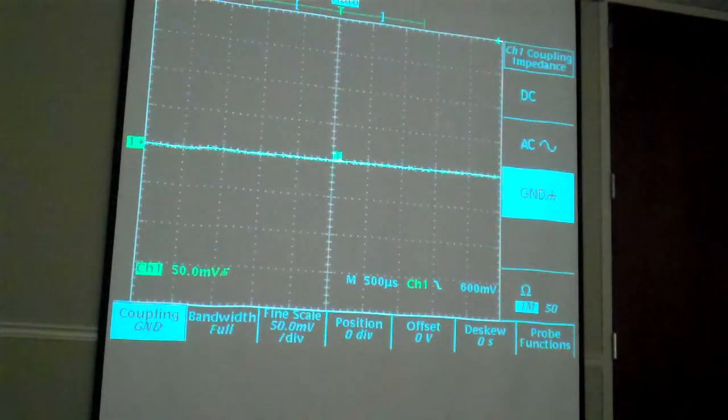Well, in the case of using an oscilloscope or any other piece of test equipment, that's something we always have to keep top of mind as well. Whether it be a multimeter, oscilloscope, or whatever, anything you attach to a circuit will in some way slightly change the behavior of the circuit. Your typical oscilloscope probe has 10 megohms input impedance. There is a series resistor inside the probe, and a small trimmer capacitor. Everything in the electrical world has capacitive reactance and inductive reactance, even the leads going into an integrated circuit. You can't get away from all that, so you try to minimize it as much as possible.